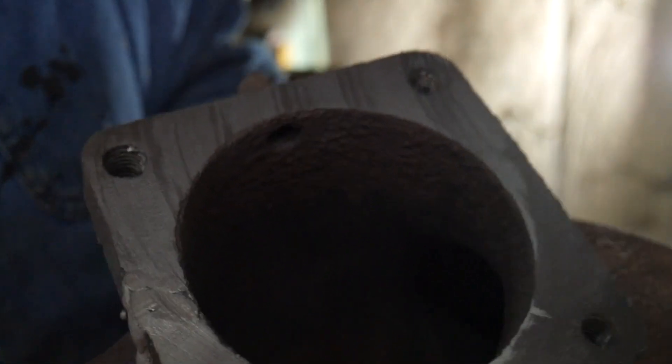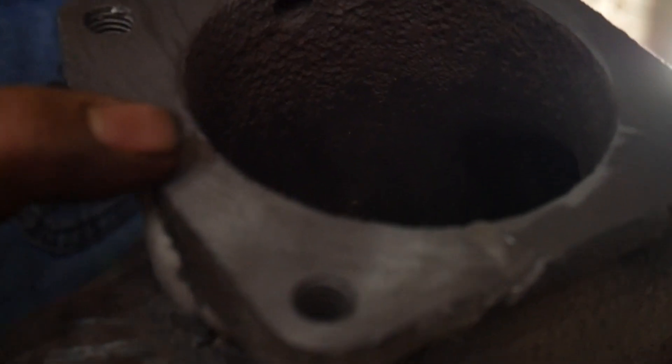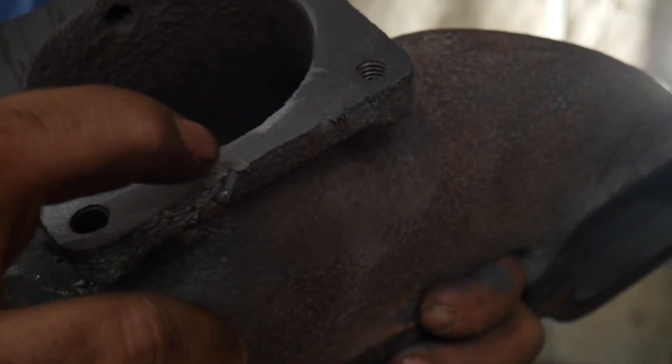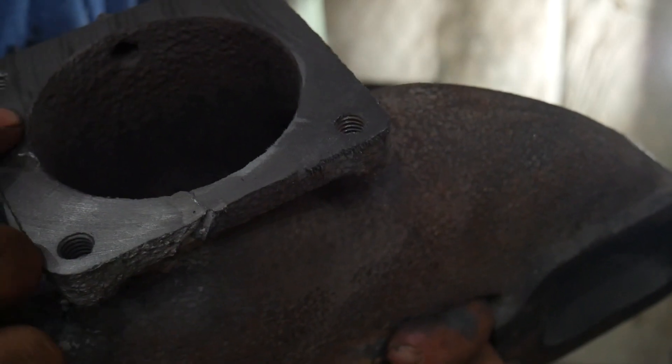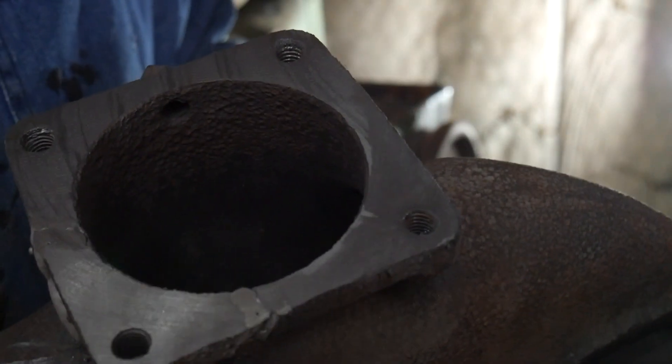This came out pretty good. My welding's horrible with the nickel - it's got just a slight porosity in the weld. Very small. I think it'll probably carbon up. This one's got a good sealing surface. Anyway, that's nice and flat.